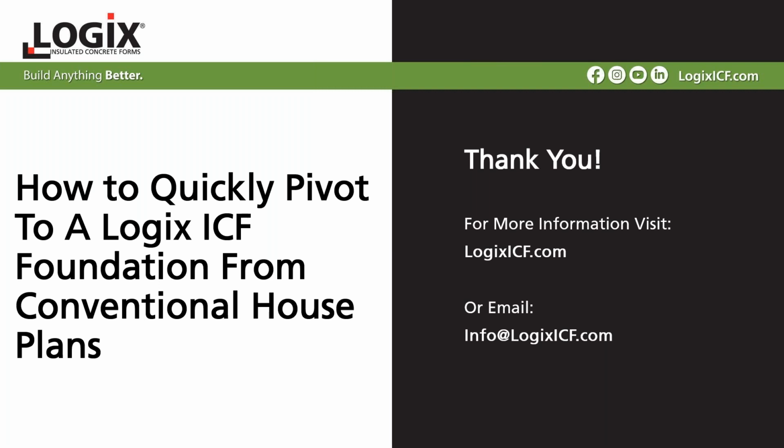All right, thank you. And Tristan has a question. Does Logix ICF carry a fire rating? I'll throw that over to you, Francis, to start. Logix does carry a fire rating. Our 4-inch concrete core has a 2-hour fire rating, and pretty much anything above that is a 3 or a 4-hour.